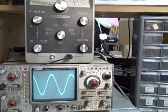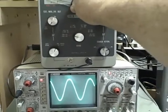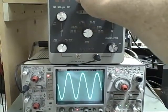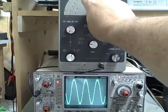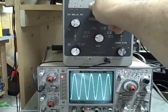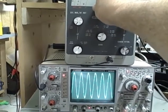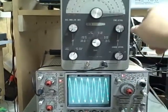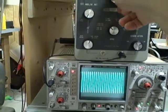I'm going to turn this light off behind us — it'll make it a lot easier to observe the scope. Let's go ahead and turn up the frequency. As we sweep across the frequency range on the vernier, you'll be able to see that the waveform amplitude will change, will grow and shrink at different points, because the efficiency of the generator is different at different frequencies.